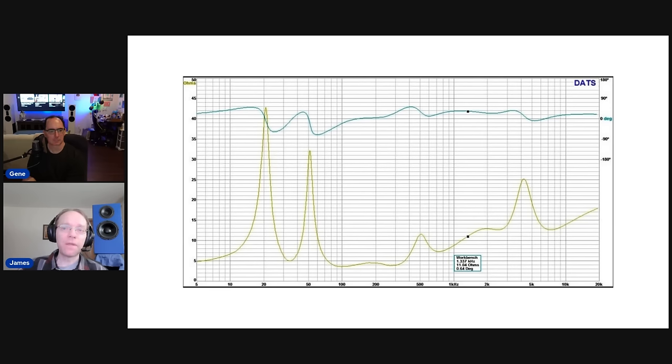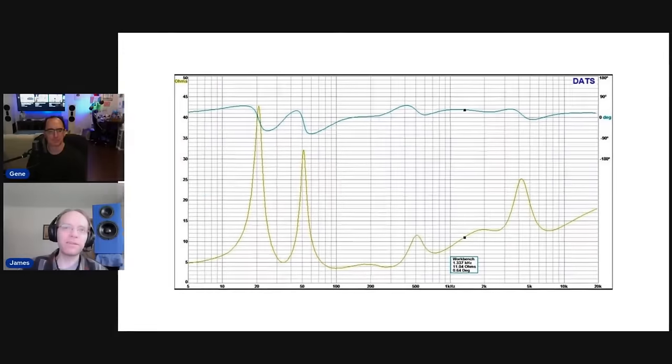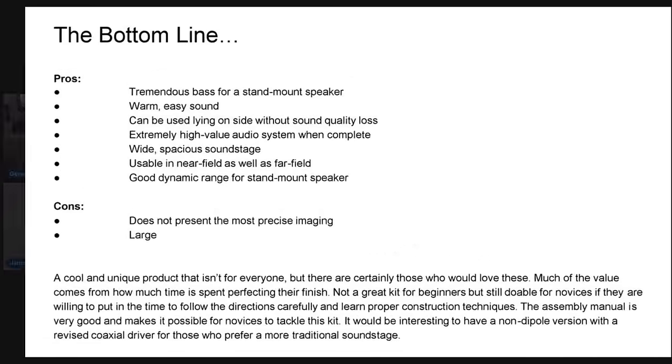Here's the electrical impedance and phase. Not a lot to say — there are just no problems. It's a four-ohm speaker, but nothing problematic. I wouldn't use a really cheap amp cranked hard for hours, but on any AVR it'll be fine. The engineer did his homework — the impedance minimum stays above the CEA recommendation of 3.2 ohms for a four-ohm speaker. The saddle points are symmetric and the phase angles aren't extreme. No news is good news here.